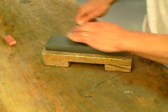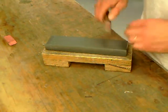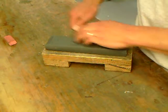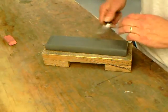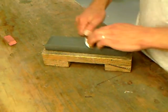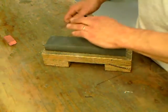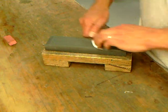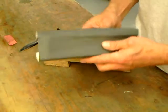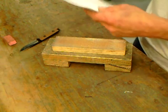Otherwise, all you'll be able to do with your compound is polish. That's why the prevailing wisdom is: if you're stropping, you need a fairly heavy grit if you're going to restore any real wear on an edge with a regular strop — otherwise you're just going to round the edge. But the washboard is mighty dense, and all those points, when you start applying pressure, generate an awful lot of push that you can use to turn your regular sheet of paper into a hone pretty much.